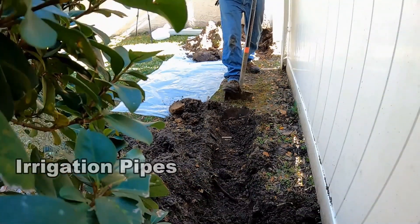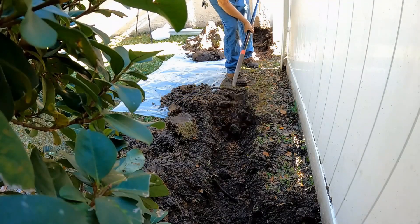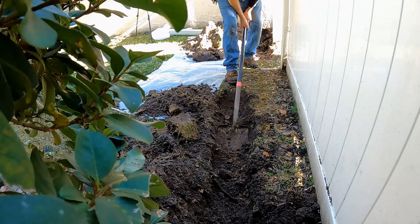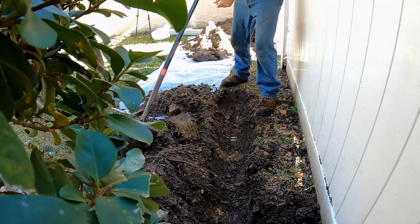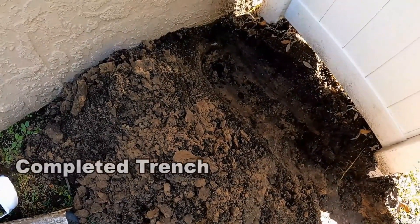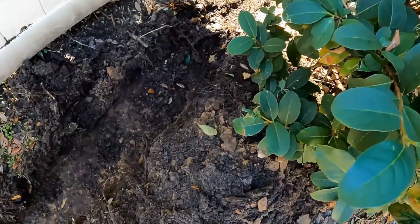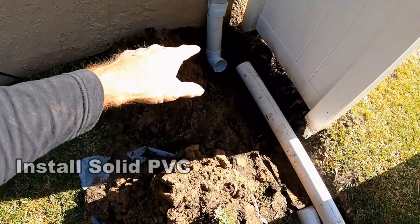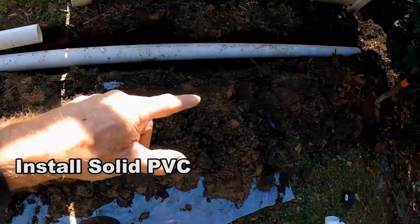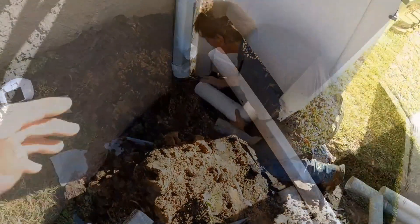That's irrigation — we're kind of right in our way, but I think we can go right on top of them. Yeah, that's perfect; they're at the perfect depth, our trench is just right. From the downspout we're going to hook up solid PVC — there'll be a downspout adapter — and you can see it just runs down through our trench and it's going to discharge right here. I just gave the water a place to go by going around the corner: downspout adapter, a little riser to a 90, then we run our pipe out and put a pop-up discharge at the end.